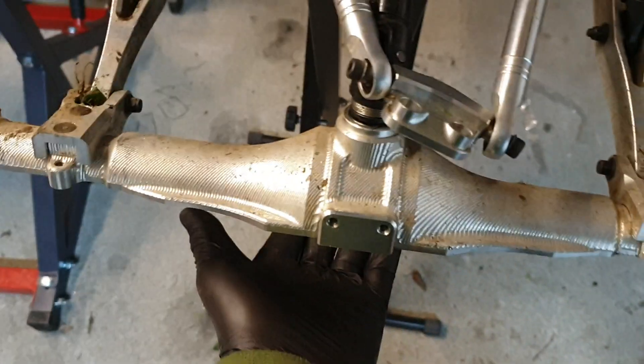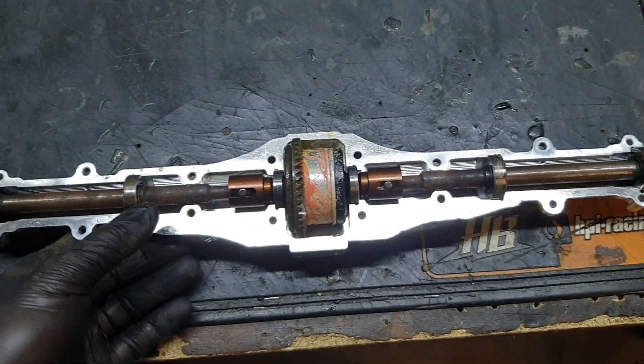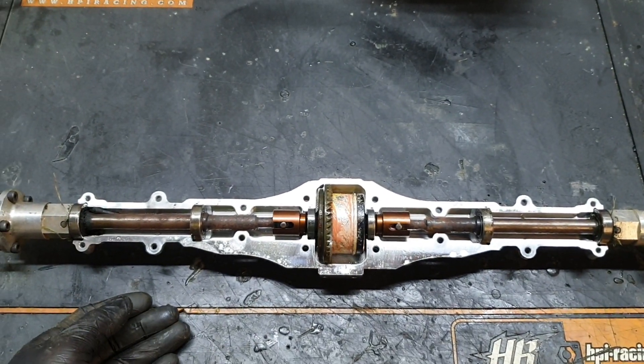The best thing to do is loosen these top four screws and let it flop down like so. Then hold your hand underneath and with a wooden hammer just give it a couple of knocks — boom boom — and it literally just drops into your hand. Otherwise you'll try to stick stuff in to prise it apart, but just let gravity do the work with a bit of a knock from a hammer.